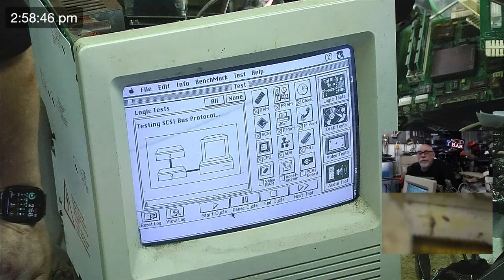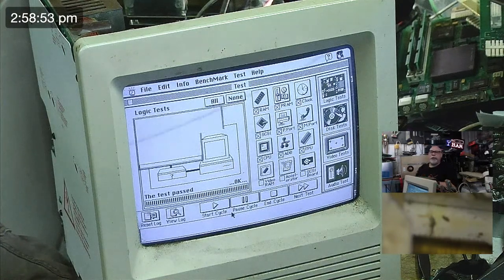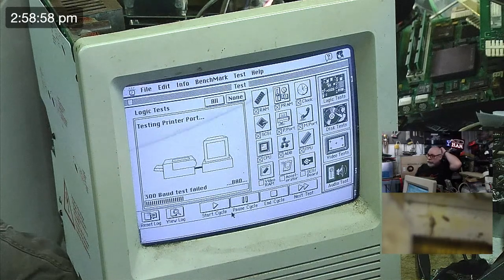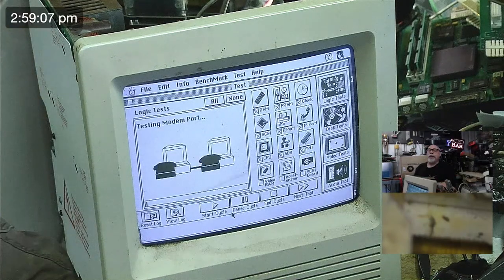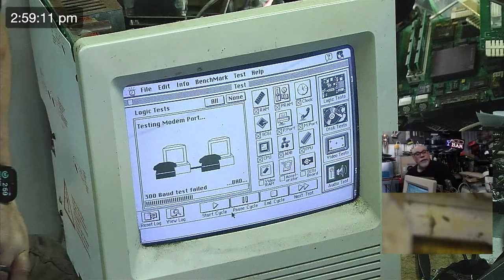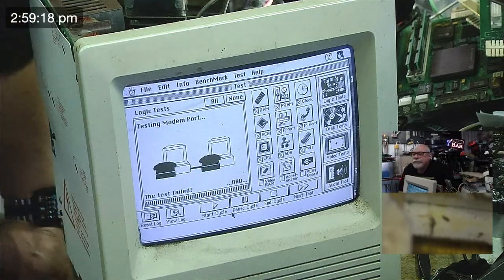Testing real-time clock. I'm happy that the real-time clock's working because that's one where I've done all sorts of stuff with it. So I've got to ultrasonically clean it. I've got to put UV mask back on that repair that I did. It won't need much ultrasonic because it's already been properly cleaned. This is just getting any of the flux that I put on there off. So we'll only need about 5 minutes aside. And then I will UV mask it, and then I've got to put the battery holder back on. And then, of course, I have to test that the battery holder is working with a battery in it and it is keeping time. And then assuming it is keeping time, this can get bundled up and sent across to the other side of the planet.